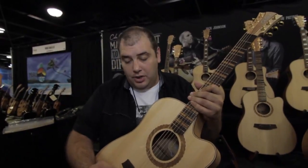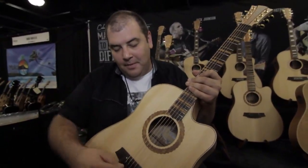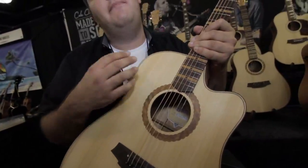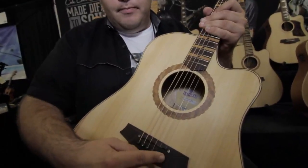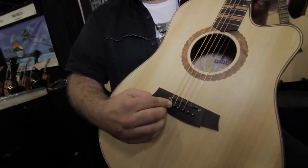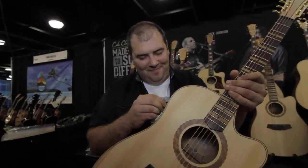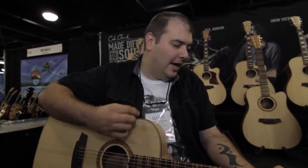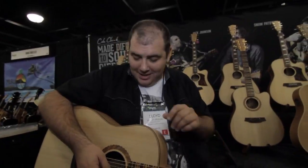An undersaddle assembly with a piezo in it, for example, is very good for bottom end. But once you hear the mid-range start to compress and you get that electronic quack — we call it the piezo quack — which we're all very familiar with. We have three elements working as one in our pickup system, each taking only the frequencies they're best equipped to handle. Starting with six loaded piezos, one for each string under the saddle for the bottom end. That's the piezo sound we're all very familiar with — a pretty good piezo sound, but a piezo sound nonetheless.